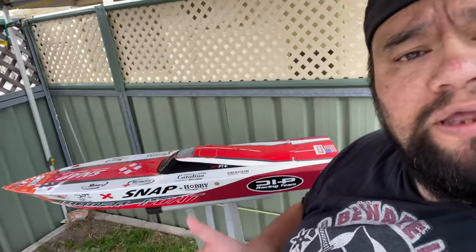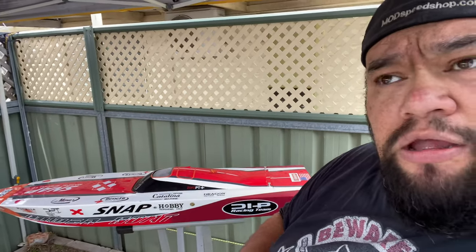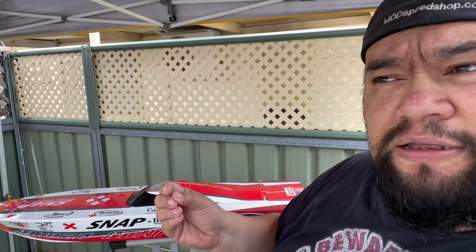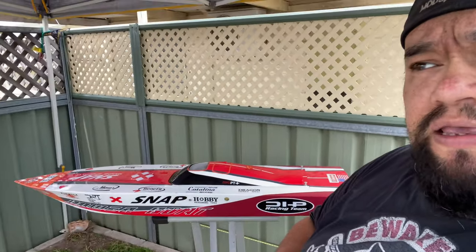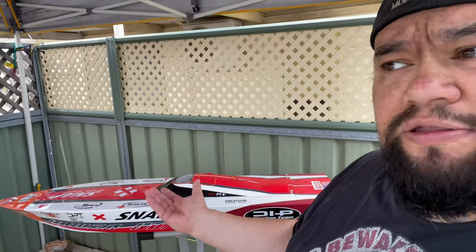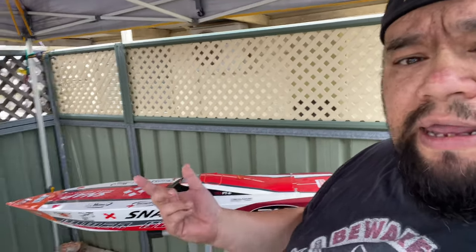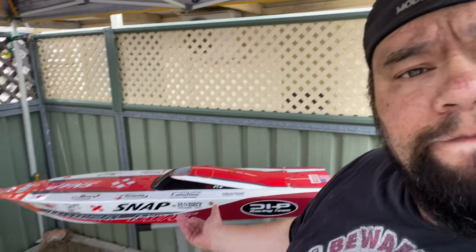So just a quick video on what we've got planned for this and what it will take to convert a gas boat, especially a large scale gas boat, into electric. I originally had it planned for 8S, but there was a limited amount of 8S boat or marine ESCs available on the market, so it only made sense, because a majority of my rigs are 12S, financial economic sense, to run the boat in 12S. I think it's a decent sized boat at 51 inches to run 12S, but then again, you've always got the option to run 8S. The next video of this will be the build video.